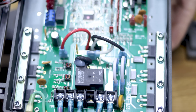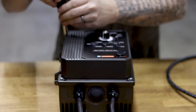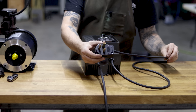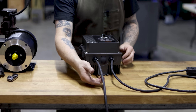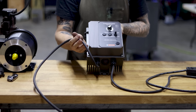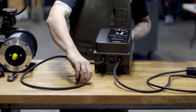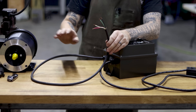That's a professional wiring job! That is all the internal wiring on the KBAC unit. We can go ahead and close the lid and seal it up. So at this point we have a 220 plug wired into L1 and L2 and ground on the input side, and the 14-4 wire plugged into U, V, W, and ground on the output side — heading to the motor.